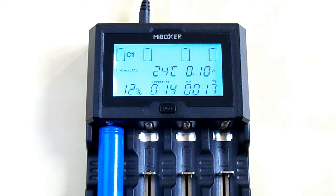This monster has an activation function for over-discharged batteries. I had a lithium ion battery which was discharged down to 0.06 volts — so it was almost dead — and I could revive it using the C412. You just insert the battery and wait a couple of hours while the charger tries to revive it by applying trickle current and raising the voltage. When the voltage is raised to a normal level you can take out the battery. It's very easy to use, simple, and very useful for those who have dead batteries.